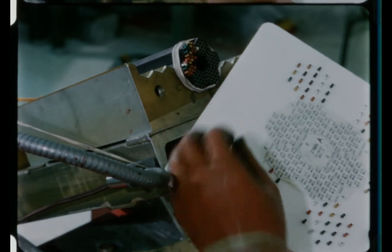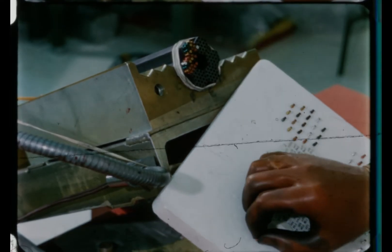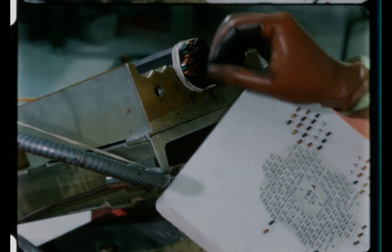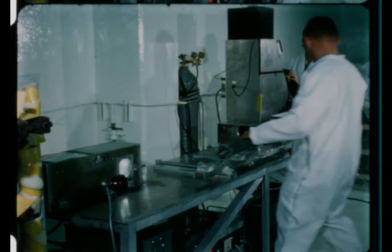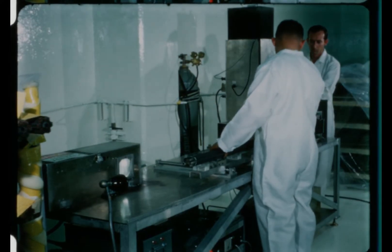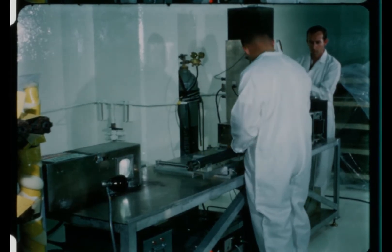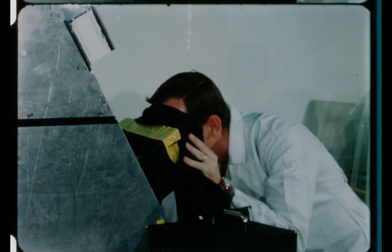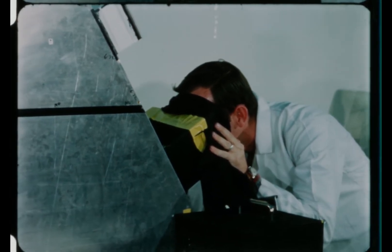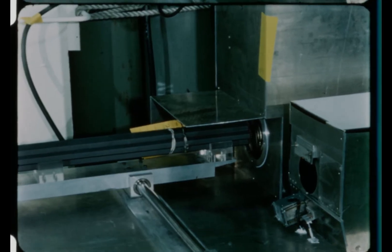In order to ensure accuracy during assembly, the calculated metering sleeve sizes were printed out graphically to provide the operator with a visual plan of the sleeves for each cluster. As a further check, color photographs were made of the cold end of each cluster. Color coding of the metering sleeves provided positive verification of the accuracy of the assembly. A second photograph, made looking the length of the cluster through the sleeves, was used to inspect for obstructions in the metering sleeves and propellant passages.